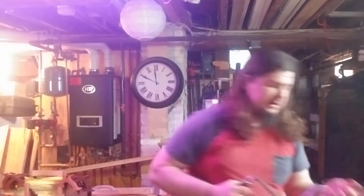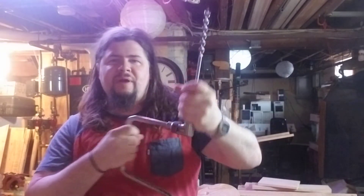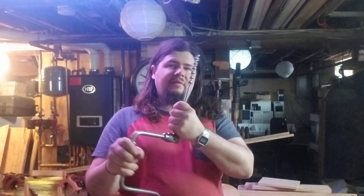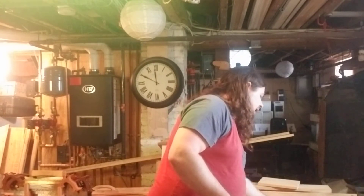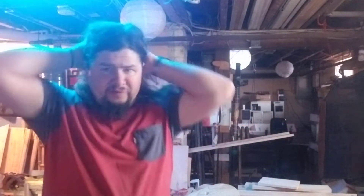What I used is this two-jaw chuck old-style auger — it's one with a 14-inch sweep. I have one with a narrower sweep that might be a little more appropriate, but this gives you plenty of leverage and that other one is on loan to someone right now. You will need some way to drill big holes — five eighths might be a good place to start, or three quarters — so it's probably going to be an auger bit, not a typical twist bit. A hand auger is really practical because you get lots of torque without lots of speed, and you don't really want a lot of speed for this.